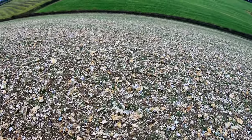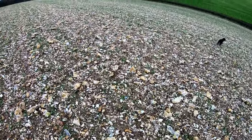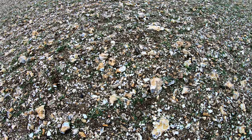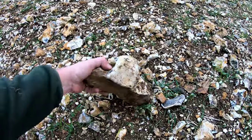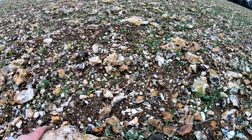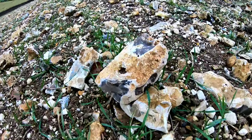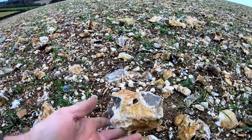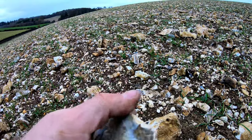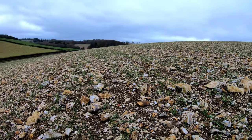For some of you out there who don't know what I'm on about when I say Hampshire Diamond — it's basically just a flint. This is a field that I was drilling on in a previous video; it's called Warhill. And yeah, these are our Hampshire Diamonds. As you can probably see, they're fairly large and the ground is absolutely covered in them. There's a bit of chalk mixed in with it as well here and there, but yeah they're pretty big and there's lots of them. And this is what wrecks your machinery — they're sharp as anything. I mean, it's a stone age tool at the end of the day. And they cut your tyres, shred them to pieces, and chip all the paintwork off your machinery.